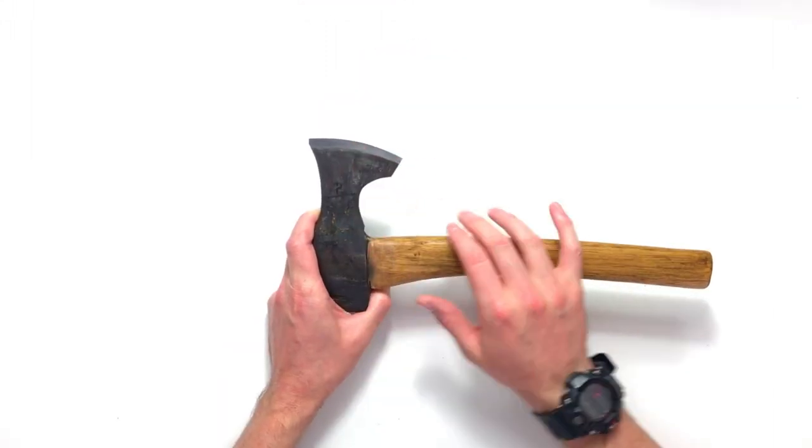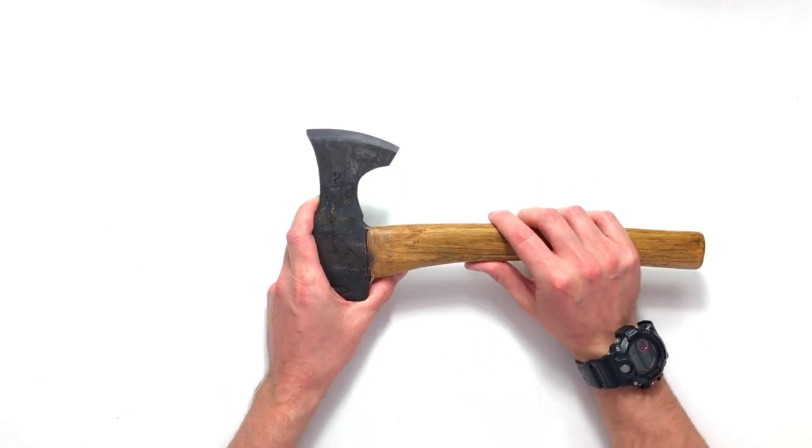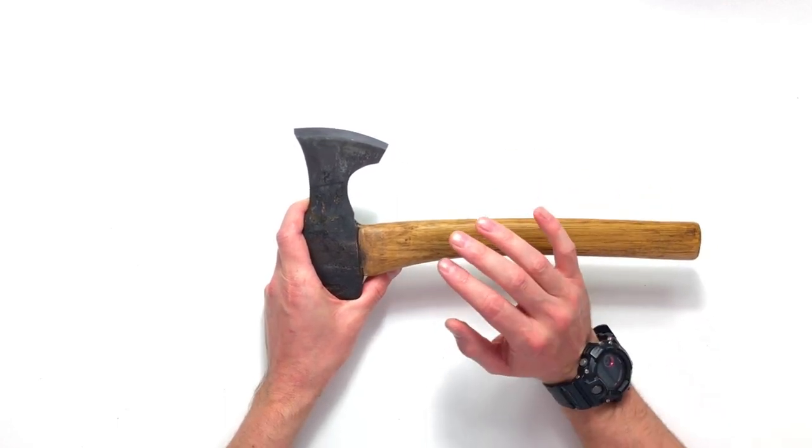So we know this edge is pretty good. I'm just going to start with my 1200 grit, just like I did with the Sloyd knife, and we'll work our way up: 1200, 3000, 7000. 7000 is overkill but we're going to do it anyway — it only takes a minute. You're more than welcome to stop at 5000; you'll still get a fantastic edge.